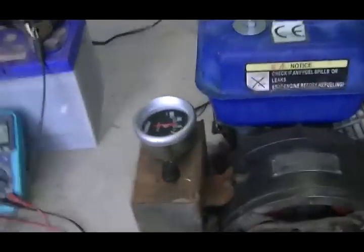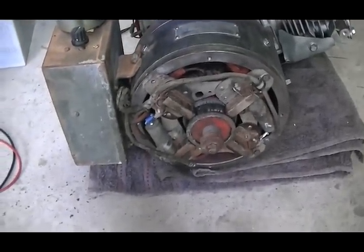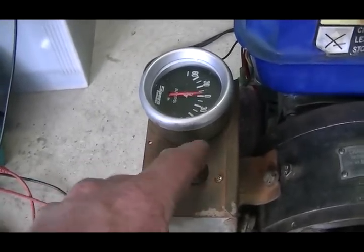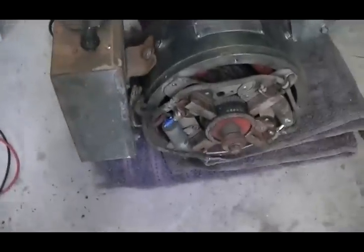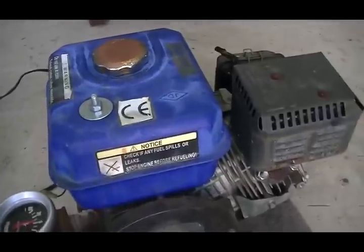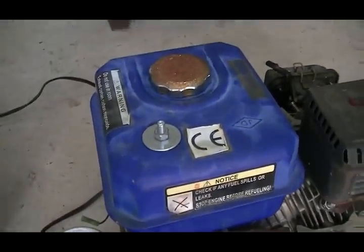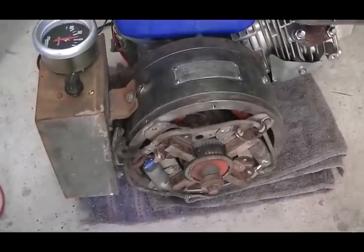This is a very neat machine — I think we've gone backwards since the days of old, and I'll show you why. Simply by adjusting this pot, I can take it from about 5 amps output up to about 40 amps at 12 volts. You can see the battery climbing. I didn't have a fuel tank for the motor, so I found a rusty old one out in the paddock. The indicator glass had fallen inside, was no good and full of water, but we've cleaned it out and it seems to work alright.